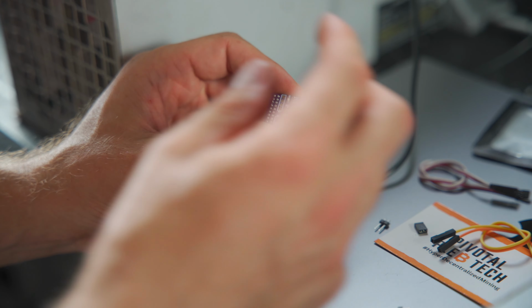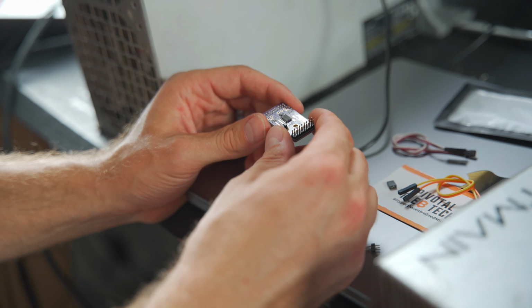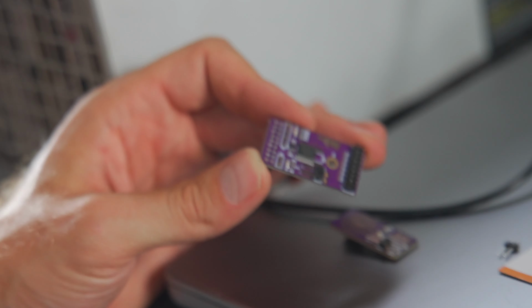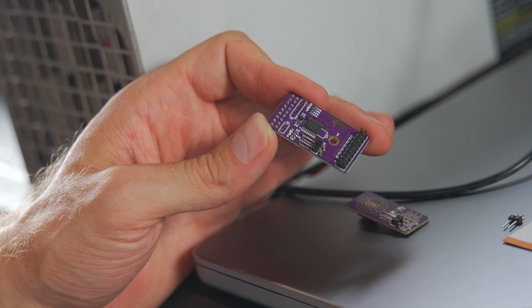So the control board will go out to the hashboard and say, hey, what's your hash voltage? And the hashboard will read the voltage and report that back. Well, it whispers lies, right? It jumps in, it lets the control board and hashboard talk back and forth to each other, but then as soon as the control board asks for the voltage, it butts in and says this is what the voltage is.